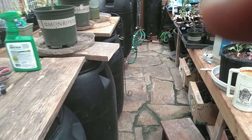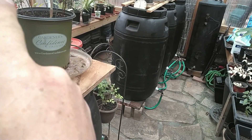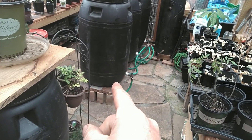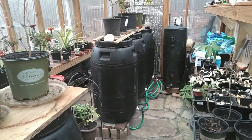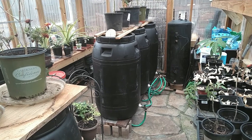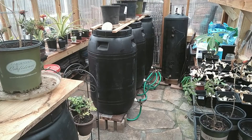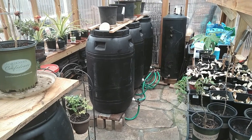Let me show you what we did. We used some pickle barrels that we had from the rainwater harvesting. I had three of them — we still have one out there collecting rainwater, and that rainwater comes in here so I can fill these up if needed. Everything in here is absolutely full. Online it says to take two and a half times the square footage of your greenhouse — that's how many gallons of water you want for thermal mass. This is 180 square feet, so we should use around 440 gallons.